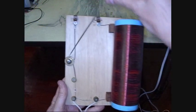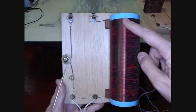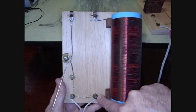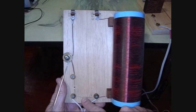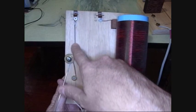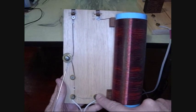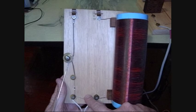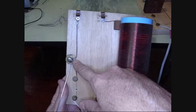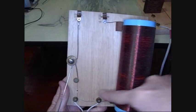So this is the original. If we ignore the tuning rod, the circuit looks basically like a big U. The antenna comes in here, goes through the coil, comes out, goes through the resistor and the earphone — the earphones are off-camera — then through the diode and up to the tuning rod and out through the ground. On the right side of the U we have the coil, on the bottom we have the earphone and resistor, and on the left side we have the diode, the tuner rod, and the ground. It's just a U shape.